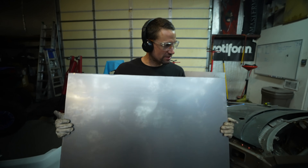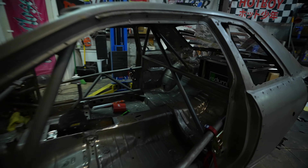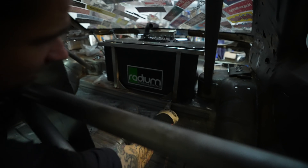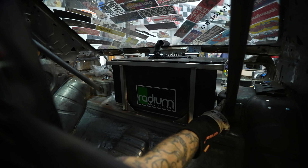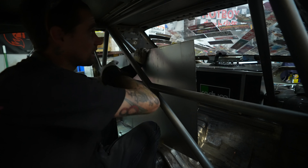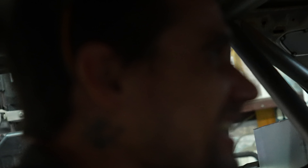This is the centerpiece for the firewall - it's going to be a three-piece firewall to go around the rear roll bar tubes, basically in front of the fuel cell. Since everything major is mounted back here, the next thing is getting the firewall up. We're going to follow the factory curvature of the rear window and have it sit right in that beautiful factory Nissan lip. Then I need to measure to figure out where to notch the piece, and figure out the curvature of the top - which is going to suck.